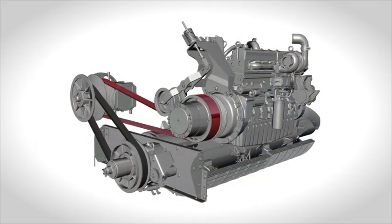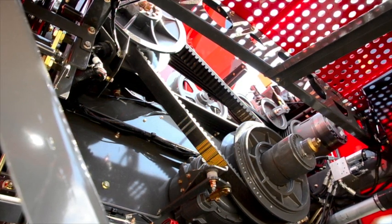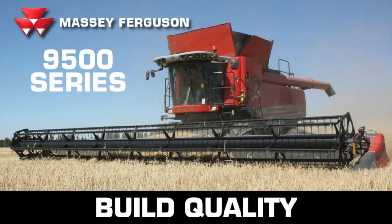That's the thing that really appealed to us — it's just very, very simple. With simplicity comes accessibility; it's very easy to get at things on the machine. It's actually a simple design — only two elevator chains on it and 13 bolts or something. Quality components in it, good bearings, big bearings — it's not lightly built. Everything in it is built to last a fair while. The quality components like FAG bearings — everything's good quality and should hopefully last.